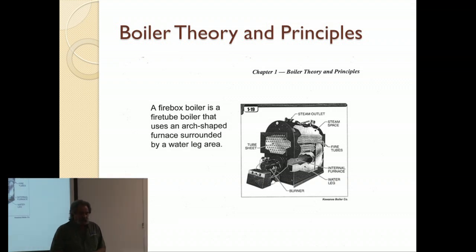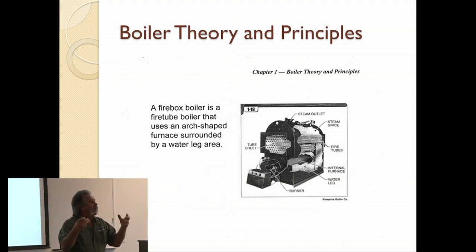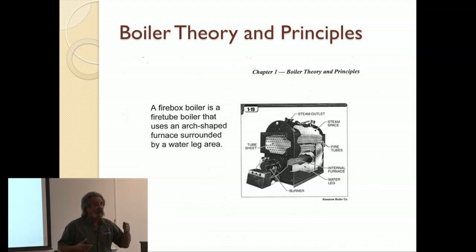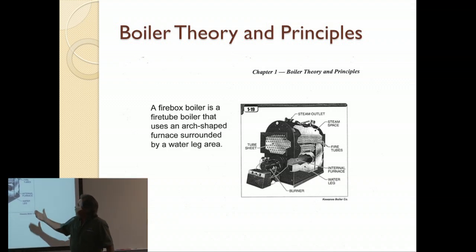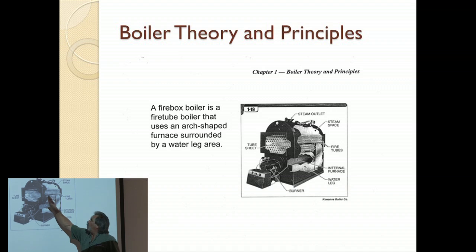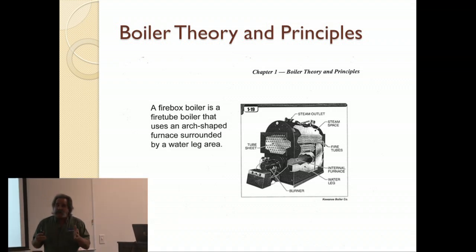Going back to the other things about boilers themselves and characteristics of them, water tube boilers have flame around the tubes. So the heat only has to travel a maximum of 1 to 2 inches from the outside edge of where the heat is enveloping this tube to get to the innermost section of water that it's trying to heat. When you go to this style of boiler, you've got a massive amount of water around it, so you could have several inches between where the tube surface is and the actual surface of the water in the middle of it. Works fine, but it's slow in its recovery.